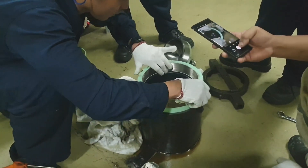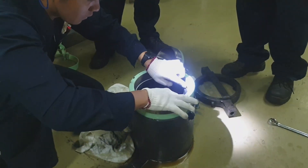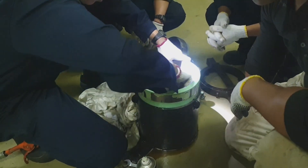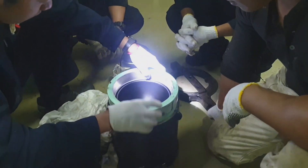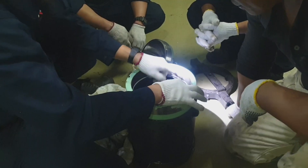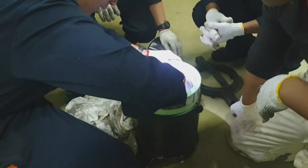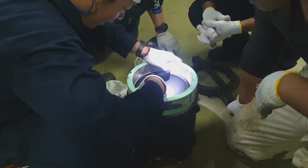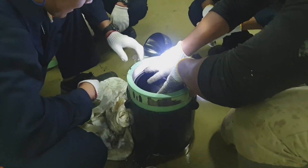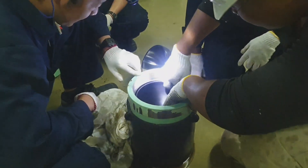Now I am installing the membrane to the lower half. Carefully mount the membrane and the backup ring must be in place properly. Be sure that it is sitting properly. Although you have the instruction book, every machinery may have a different type of accumulator assembly with its own specific instructions. This is how the assembling and disassembling of the accumulator membrane is done.